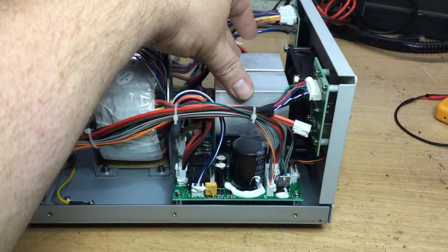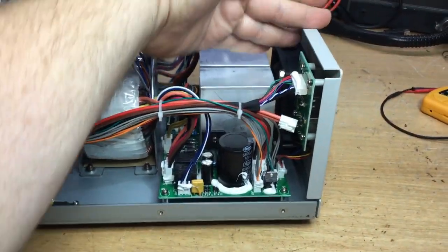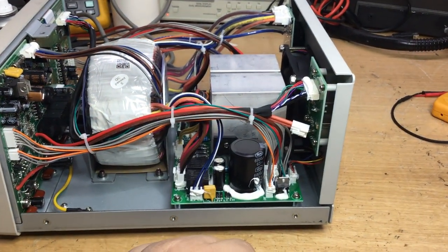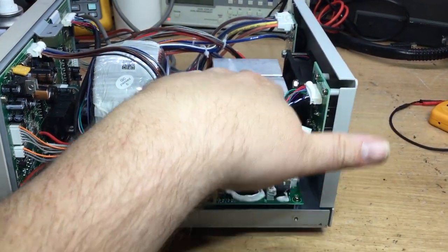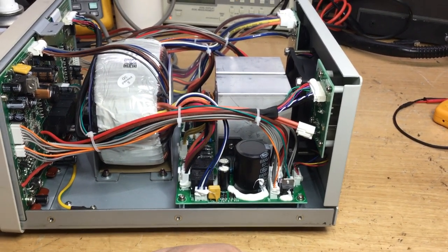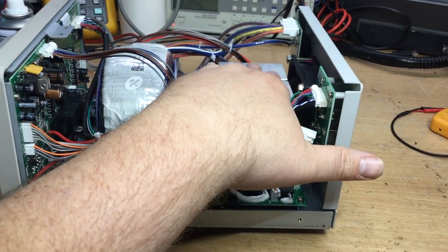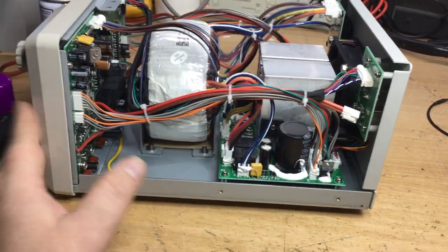So there's the potential to have some voltage on here, which if you were to go between chassis and then onto the heatsink with your hand, you could get a shock. I doubt it, but because I have no technical information on the product, I've not measured any voltage there yet with a meter, but that's what I would always do before trying to touch it. If I needed to do that, for example to touch it to see if it was getting hot, I would never just touch it without first checking to see if it was live. Otherwise, you're asking for it.